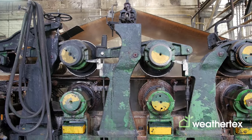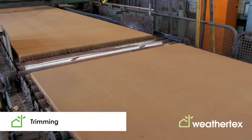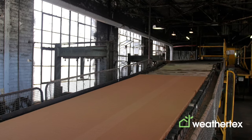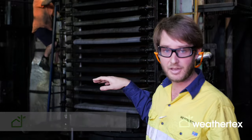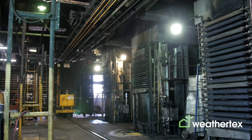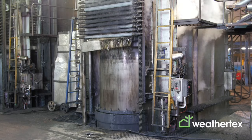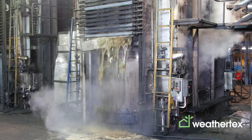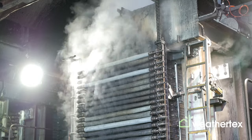The board is fully formed at this point and is trimmed with high-pressure water jets in preparation for hot pressing. At the pressing end of production, the wet lap is delivered to each opening in the press. We have 20 openings for the board to be pressed and it's a 24-minute pressing cycle. In this cycle you get a large mechanical squeeze to get as much water out of the board as possible, then the press sits and cooks for another 20 minutes or so.